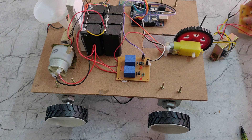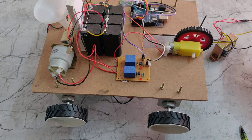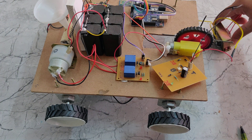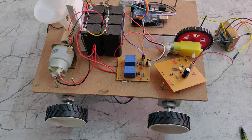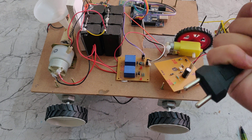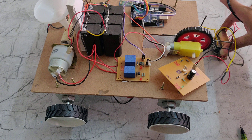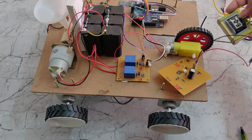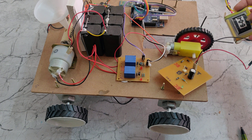This charging circuit consists of a rectifier and a step-down transformer. We provide power through a cable that takes 230 volts of AC supply to the primary of the transformer. It steps down the voltage to 9 volts AC, as we can see from the transformer ratings.